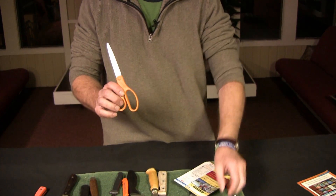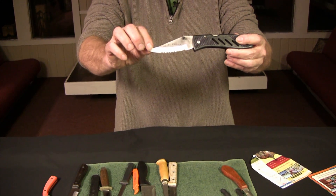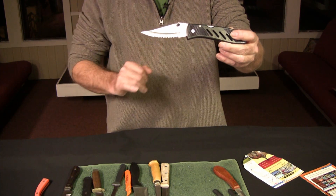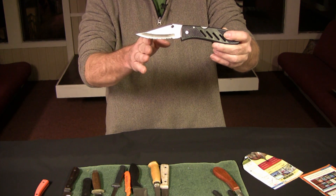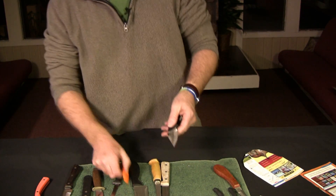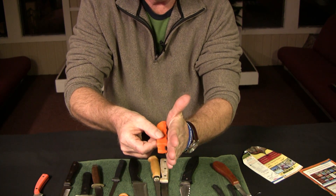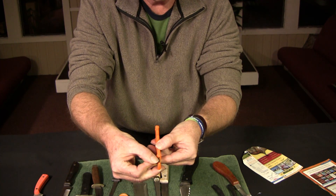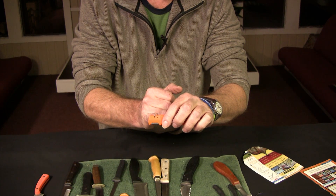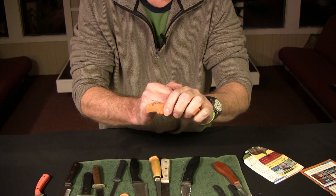You can sharpen your scissors, your pruners, and serrated edge blades like this one right here. You're going to see that there's a round hole there, there, there, there. And you wonder — how do we sharpen the round holes and the points? Generally speaking, you can't with your regular sharpening device. If you take this sharpening device, you have a straight edge here. If it's flat and you grind at 90 degrees, you have an absolute 90-degree corner here and an absolute 90-degree corner there. It also has a V-notch on it. V-notches are for kitchen knives that don't have nicks in them.